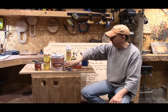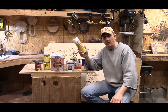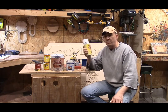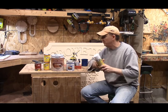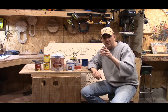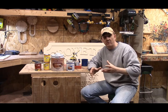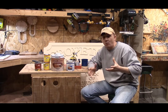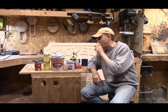Now, on smaller projects, I use Bullseye shellac in a can, a clear non-waxing formula. Make sure it's non-waxing. This seals up the pores in the softwood. I've seen some of you guys in the groups out there, probably even some of you ladies. You go to paint something, and the next thing you know, you can see that dark paint run up through the vein of the engraving on the outer edge. Well, it's because the softwood's pockets and pores are wide open, and unfortunately that's where the paint chose to go. This is why we seal.